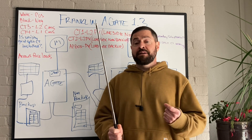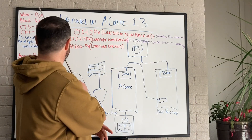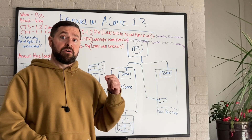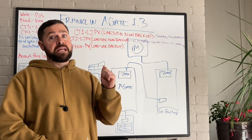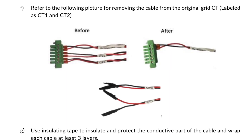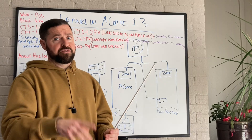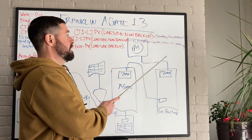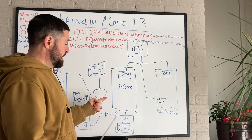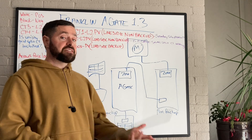Switching the CT wires is the same as pointing the CTs in the wrong direction — that is reversed polarity. If we install in this configuration using CT3 and CT4, with consumption CTs upstream of all home loads, we need to go into the built-in energy meter and un-terminate those built-in CT wires from that port. Wrap them in at least three layers of tape so they don't touch any current-carrying conductors or cause faults. There is amperage that comes out of those CTs as current flows through them, so it's very important you tape them off and abandon them. If you leave both sets of CTs terminated, it will double the readings of non-backed-up loads.